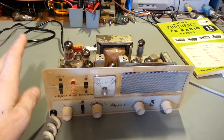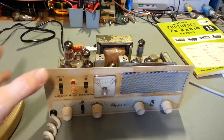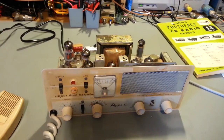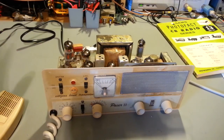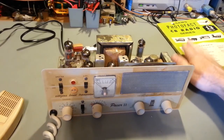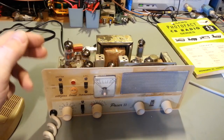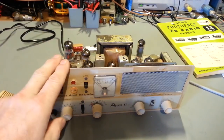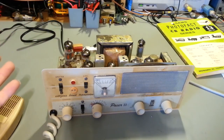But like I say, a lot of those companies, they'll stand behind it if you buy a crystal from them, and it is out of spec. So, you know, it would need to be out a good bit. If it's off only 100 hertz, well, a brand new crystal can be off 100 hertz. But if it's off like a kilohertz, if it's way, way out of spec, basically what would be in the service manual for your frequency specs for the standards, they'll either refund your money or they'll send you another crystal. So that's just something to ask when you're buying crystals for old radios like this. If you're buying a crystal from somebody, will they stand behind it? If it doesn't work or it's way off frequency, will they either refund your money or send you another crystal? It's always something to keep in mind.